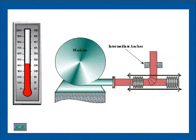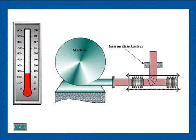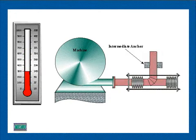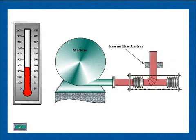Care should be taken to provide sufficient flexibility in both the flow bellows and the balancing bellows, so that the forces required to compress the expansion joint do not exceed loading limits for the equipment, as established by the equipment manufacturer.